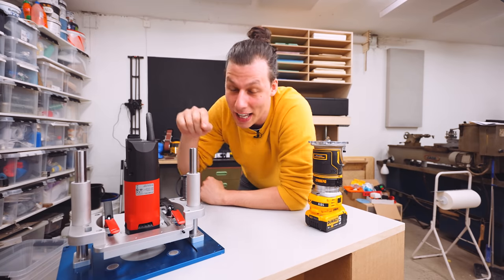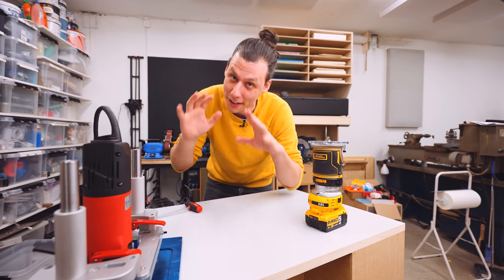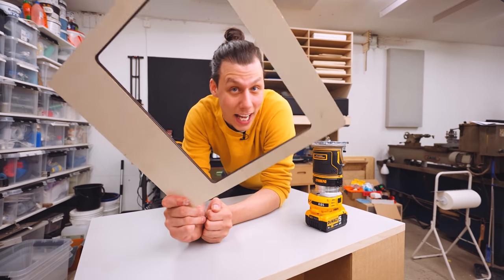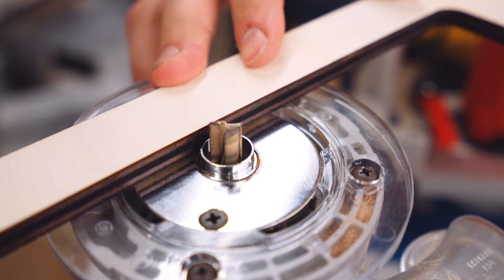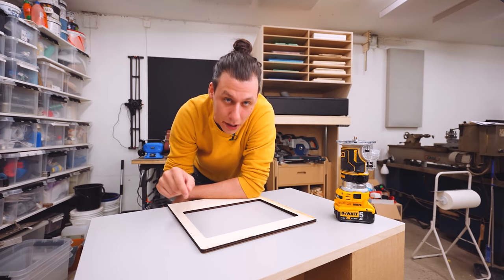The OFL 3.0 has 1600 watts and will spin up to 30,000 RPM. But before we get to take advantage of that, we're going to need to cut a hole that all this can fit in. To get that hole super accurate, I have a laser cutter, so I just cut a template that, with a following attachment on my router, will give us the exact right cutout for the top of our router base.